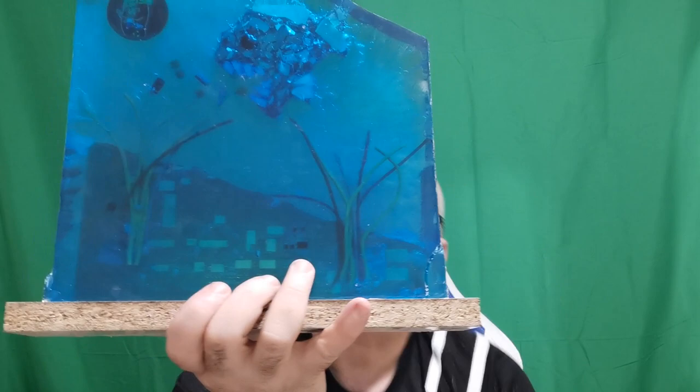So it's a nice sunny day today here in Ireland. So what I'm going to do is go outside and start sanding this down. I'm going to start off with rough 80 grit sandpaper to try and get it smooth, get rid of all the imperfections on the surface. Then we'll go from 80 grit to 120, and 120 to 500, 500 to 1000, 1000 to 2000. And we'll see where we are when we've sanded the final of the 2000. We'll see, do I need to get finer sandpaper and stuff like that.